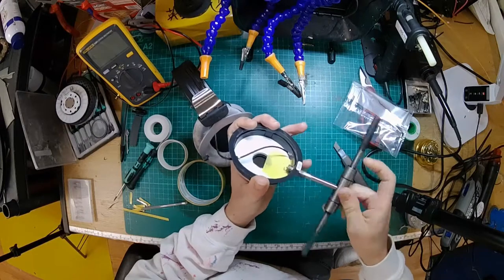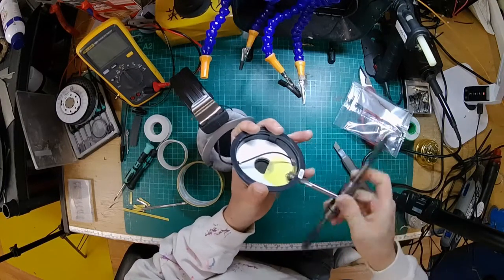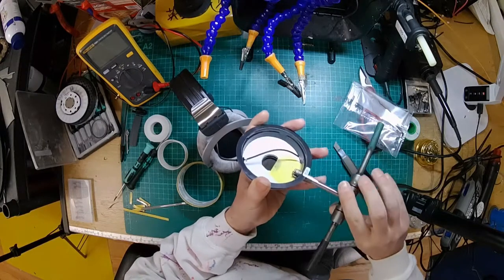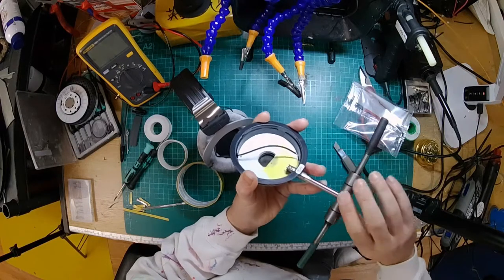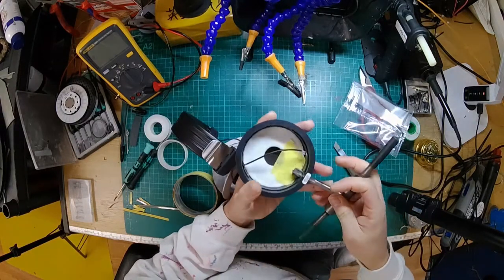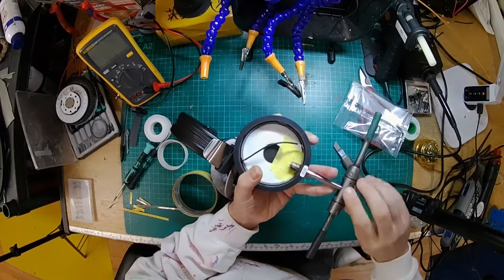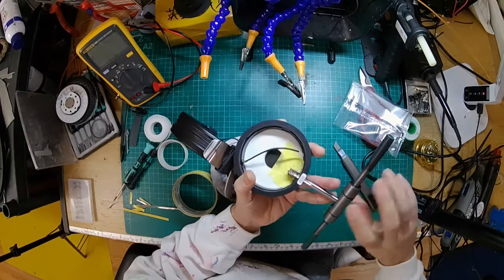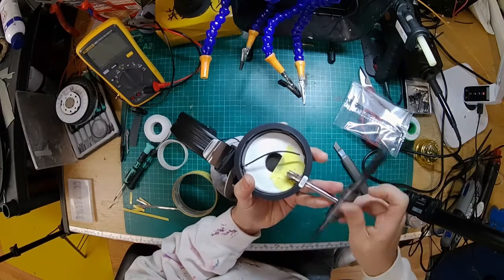Now, I know if you were tapping into metal, you'd have to go back, do one and then go back half a turn. But because it's relatively soft plastic, this is fine. You'd have to clear the swarf, and we're going to go through a thin bit. There you go, you can see that coming through there. The tape's doing its job, we're not getting loads of cotton wrapped around the end of it, which is nice.